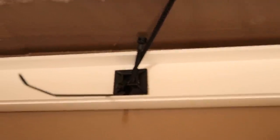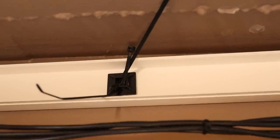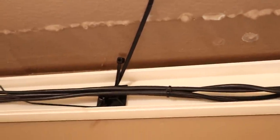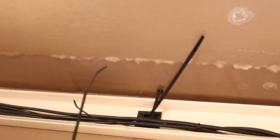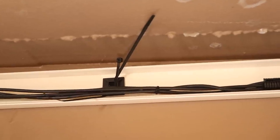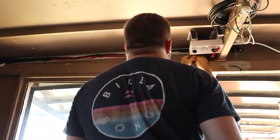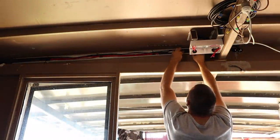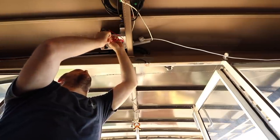A couple of little tricks when using these black adhesive pads: stick two zip ties in it — positive negative or left and right depending on what you're trying to separate — before you start putting your cabling in. Also when you go to put your cable in, you want to kink the end of the zip tie just like this, so you've got a standard zip tie with a kink in the end. It just helps you push it up and through the little holes in the adhesive pad. It'll save you a world of pain. Four controllers, eight panels — uber solar. You've got to be happy with that.